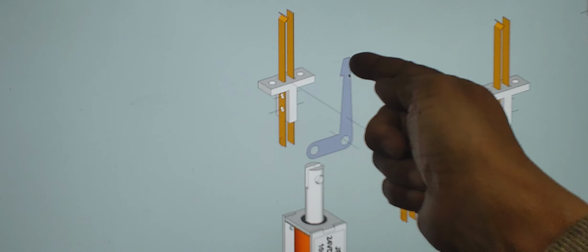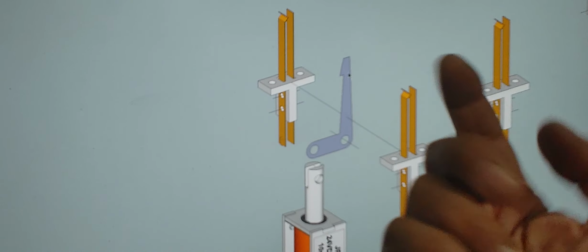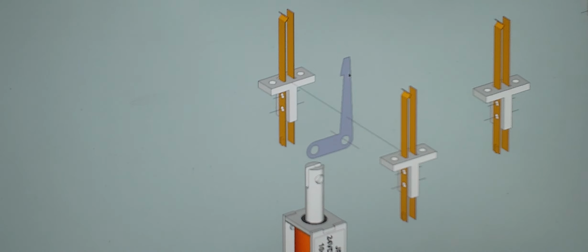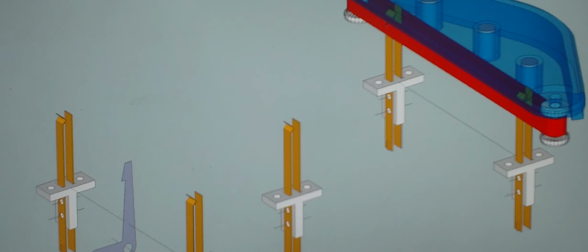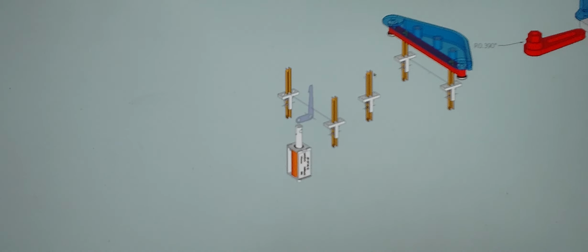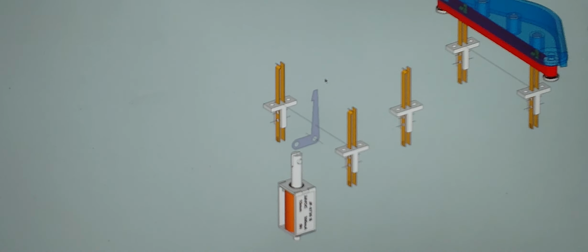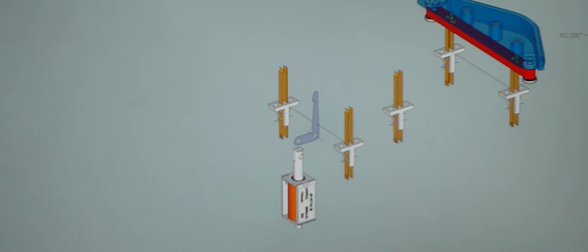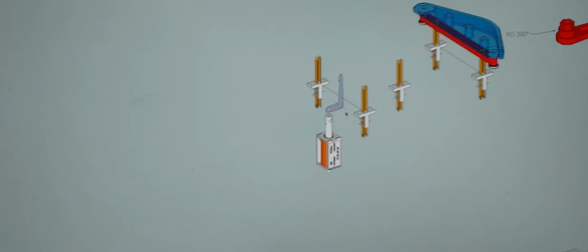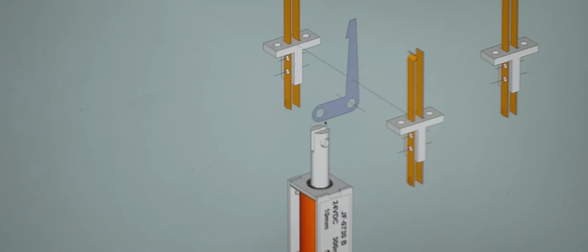And so this piece right here basically is right behind the rubber bumper, that rubber O-ring that typically these assemblies have. Right now I have a band here, but typically that's just like a rubber O-ring. I am using silicone rubber because it's got much more spring action than any other type of rubber, O-ring or band that I've used. So just keep that in mind. Silicone is much better.